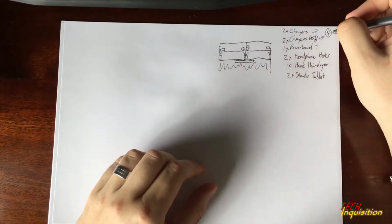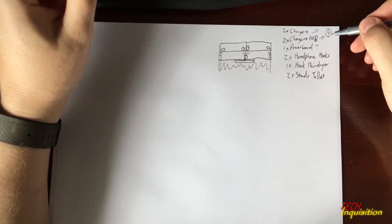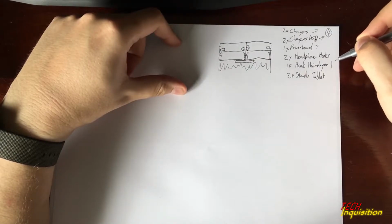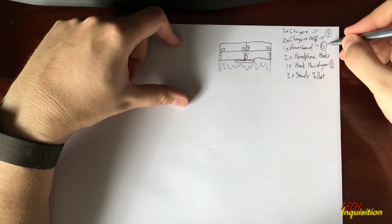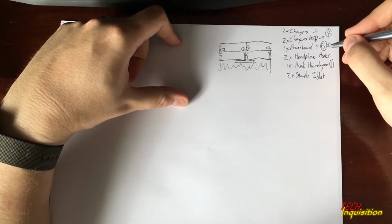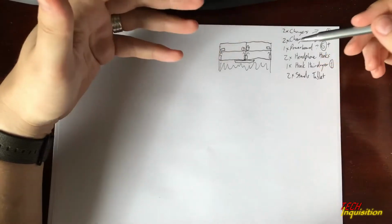Now I already know I'm definitely needing 4 power points, and I might need an extra one for, say, a hair dryer, so 5 here. So almost at least go for 6 or more. So I have at least 1 extra one in case something else is added to the recipe or the configuration.